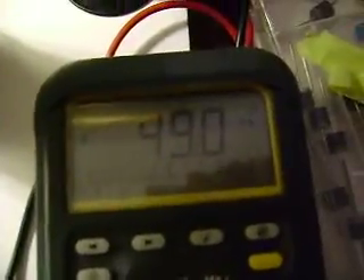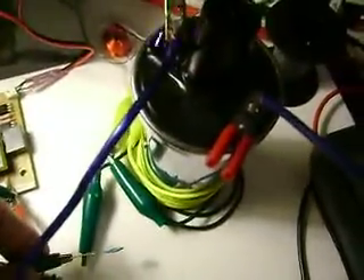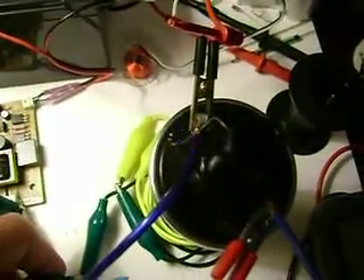On the end of our green leads, it's at the other end of our transformer. I just picked it up so you can hear things happening. It's allowing the caps to charge — we've gotten back up to 48. We're going to just touch this 1,000-volt capacitor to the end of the loop. It's an insulated loop around the casing, so it's another form of capacitance with the steel container of the coil. Now we're going to attach it directly to the casing with the capacitor.